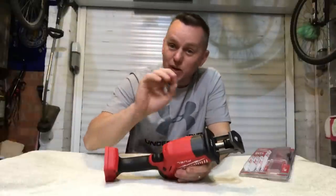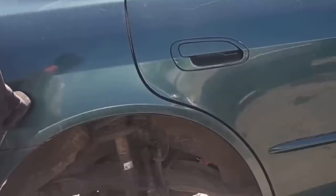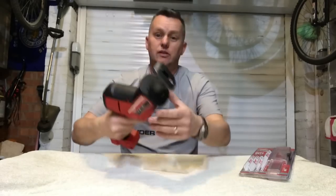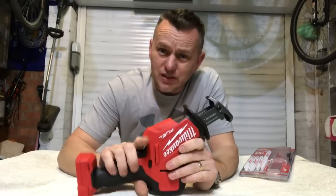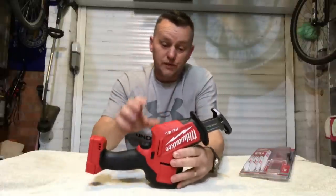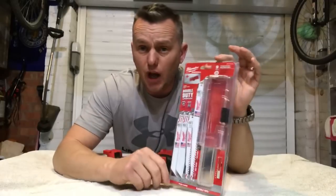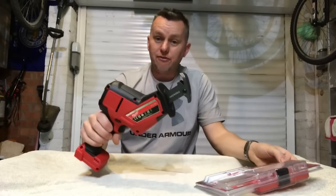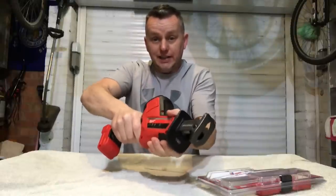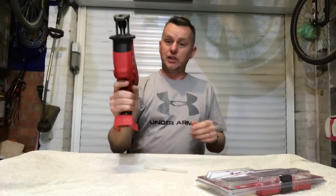How good was that? Compare that to the sawzall — there's not a lot in it, but this definitely has more power. The stroke is 10 millimeters longer and it really does monster it well. One of the first things I needed to know: this takes exactly the same blades as the sawzall. The only difference between this and the sawzall is all single-handed operation — you can do two-handed if you really need to. The sawzall is all about two hands; it's front-weighted, but this is a lot more balanced.